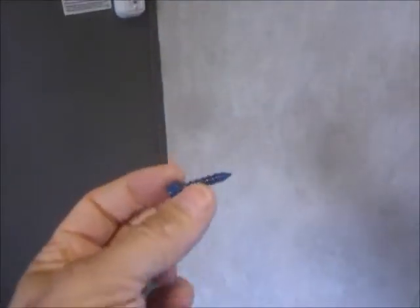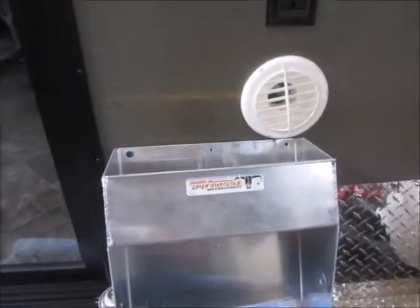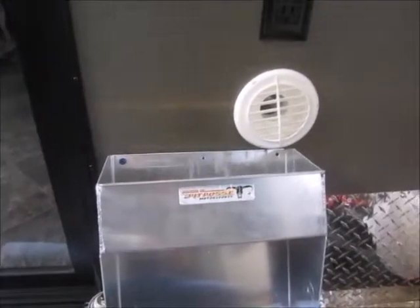There are no studs in this wall where I want to put the chemical cleaning box. There's a stud right above along the door here, and all the way over to here. So I'm going to use these big concrete screws — I couldn't find anything else short enough at my local hardware store. I pre-drilled the holes. We're going through just quarter or eighth-inch plywood paneling into the high-density foam. I believe that will be enough to hold it up there; if not, I'll have to use anchors at a later date.